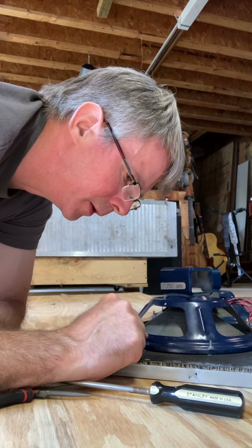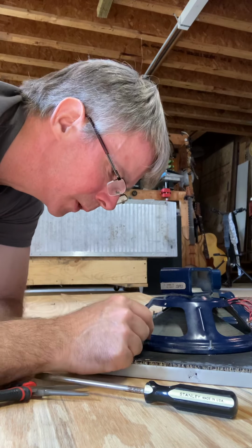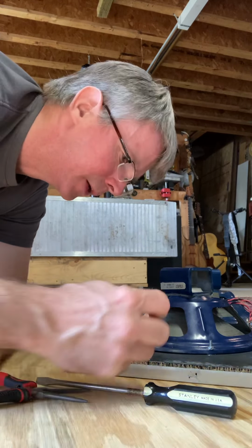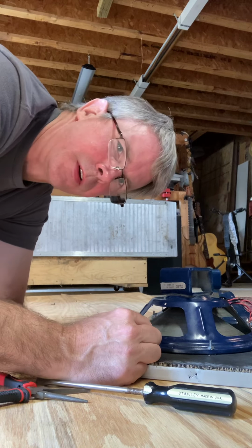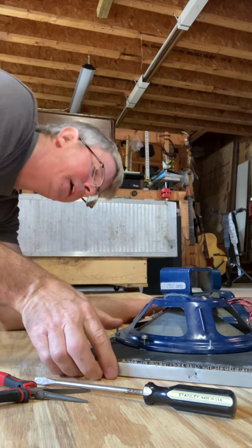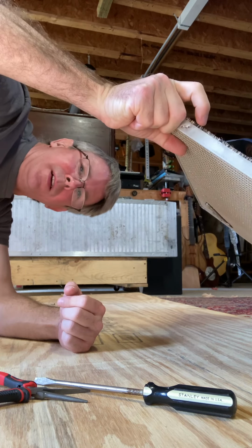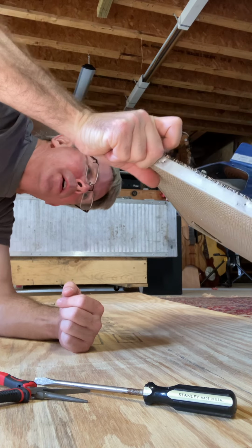This one stud that goes through this hurricane nut in the baffle had backed out, and so you have the stud, you have this little nut here, and I noticed that as I started to tighten this nut up, the screw started backing out, and I could feel it pressing up against the baffle here. I could feel it backing out into the baffle, and it was like a big lump there.